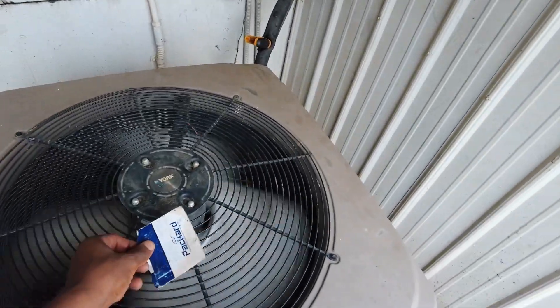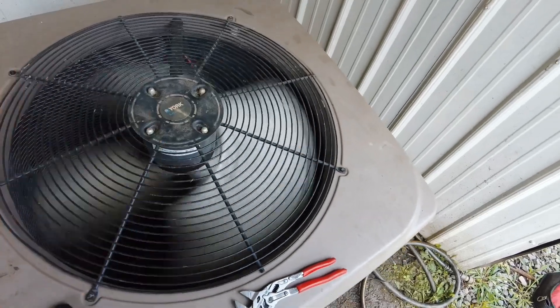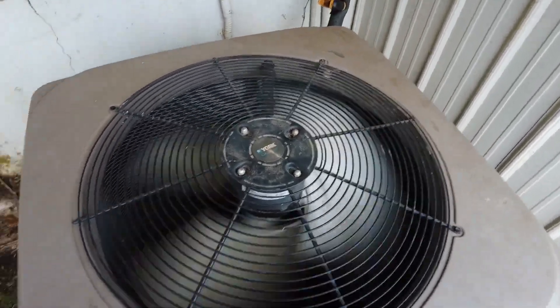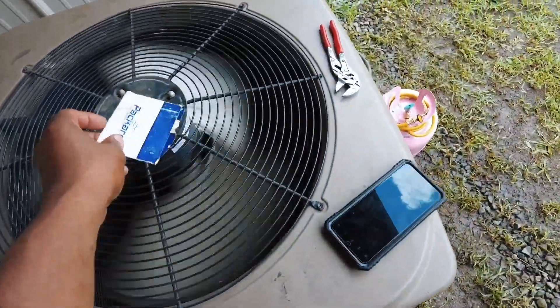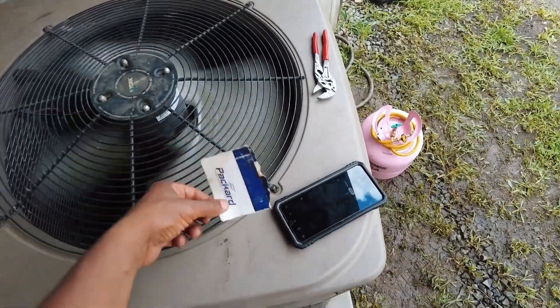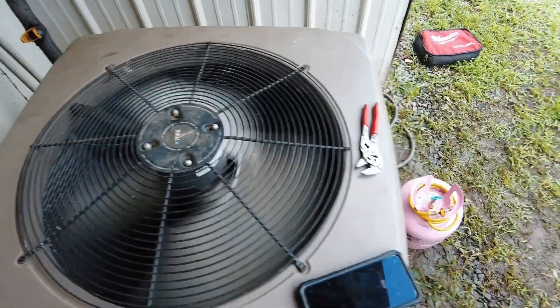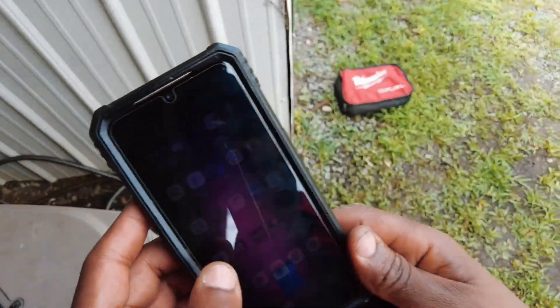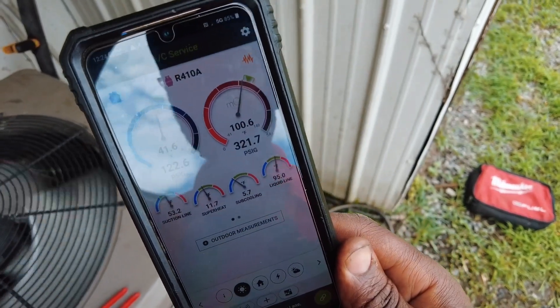Now as you can see, there's no heat placement at all anywhere on this coil — it just completely flies off. That's the way your coil should be rejecting heat. No matter where you place your hand, it's not going to stay. Had to add about a pound of refrigerant, but other than that she's looking good. We'll see you on the next one, thanks for watching.